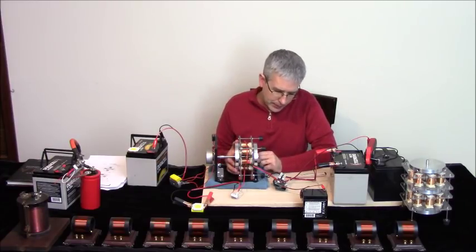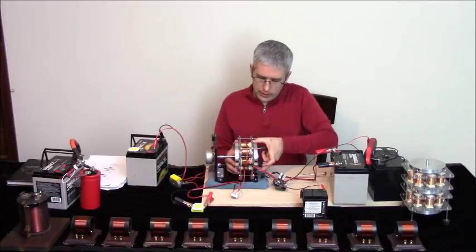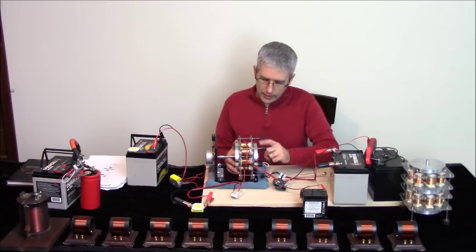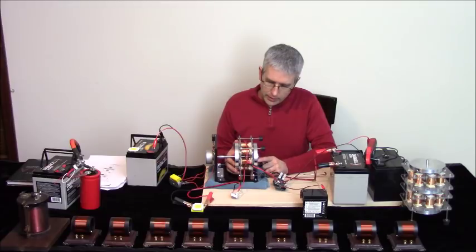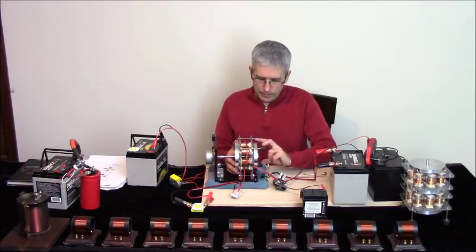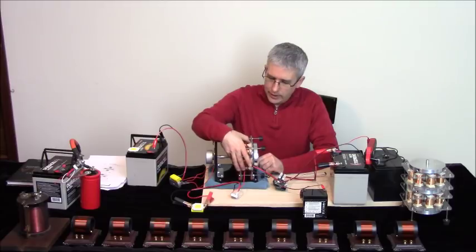Oh, and then the upgrades on the circuit board are that, which we did recently with the other older kit, going to Arduino board, and it's going to have two MOSFETs on it instead of one. So two coils for one MOSFET, two coils for the other MOSFET, and then four generator coils. This will not have the ability to run, well, if you had two independent circuits, you could run the other coils out of phase, so you could do that if you wanted to, but there's so much power already that we actually have to load it down. So we load down the generator coils.